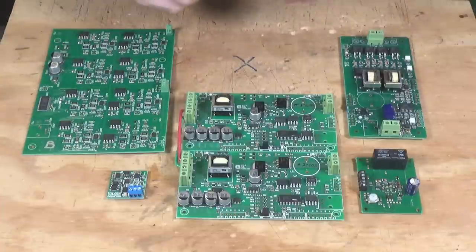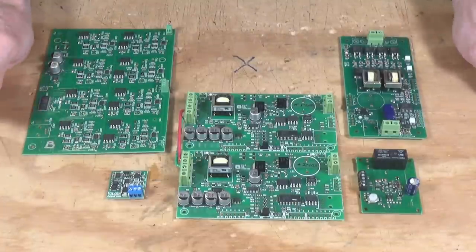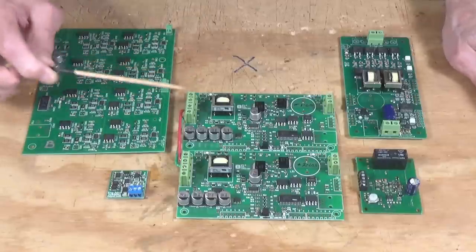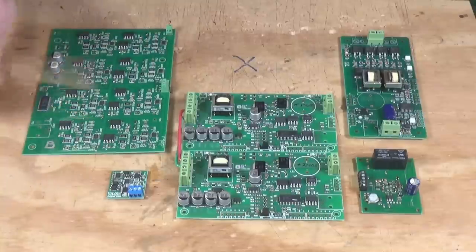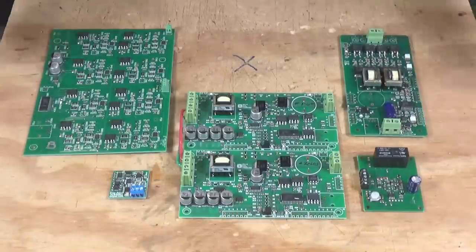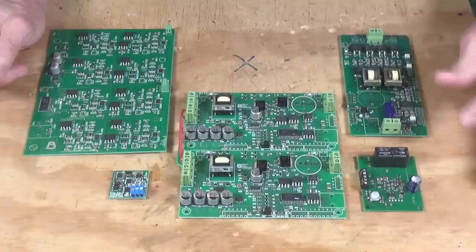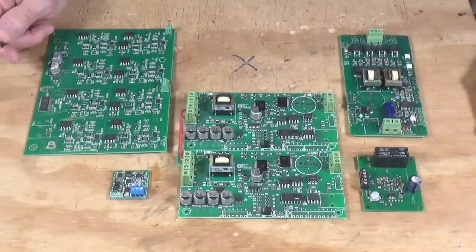So what can you do to avoid these problems? One reality of electronics is that electrons — and therefore electricity — move at pretty close to the speed of light. So even microprocessor-controlled devices cannot respond fast enough to prevent those voltage surges and spikes from reaching your decoders. That's a reality of electronics and physics, and it's not going to change. You're always going to need auto-reversers where you have reverse loops, so be aware of it and don't be afraid, but do be mindful. You can get away with two or three; do not overbuild your layout with lots of fancy trackwork that creates reverse loops, because you potentially build in trouble for yourself.